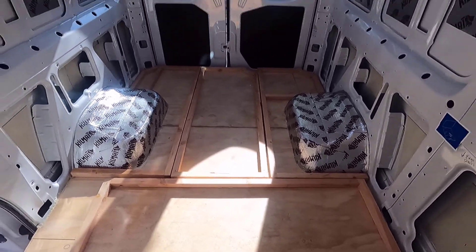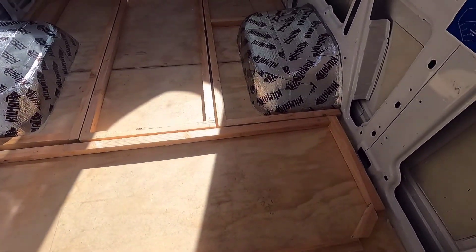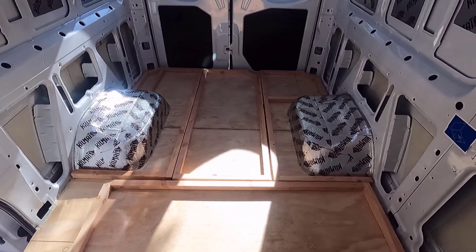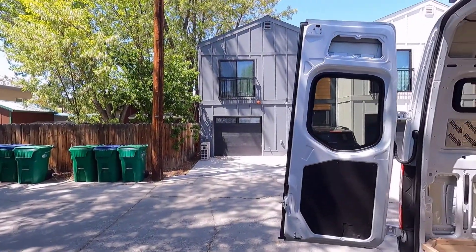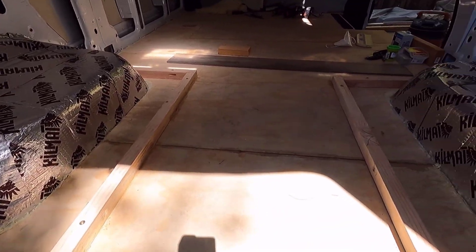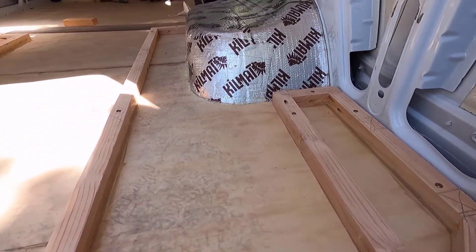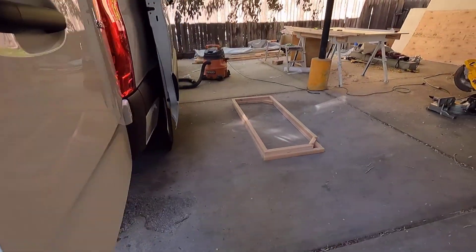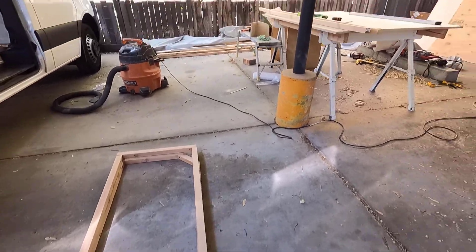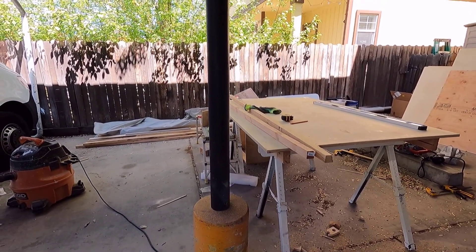So that's all of my frames. I've just got them in here drying at the moment and I've run out of materials so I'm going to get them tomorrow. It's been a long day and I'm really happy with what I've done here. I installed the two base frames — they've been glued and screwed to the floor and they ain't going nowhere. And then what we have here is the top of the dinette, onto which will become a lid. Now I just need to cut 20 eighteen-inch frame pieces for the vertical struts.